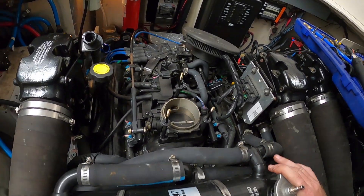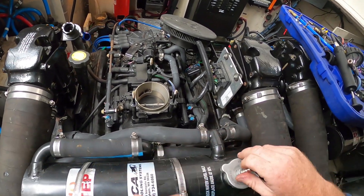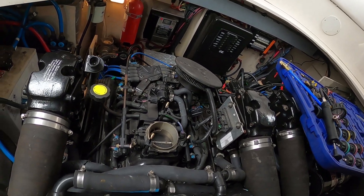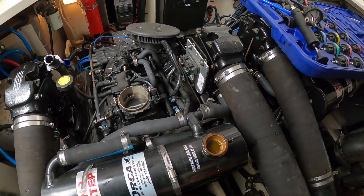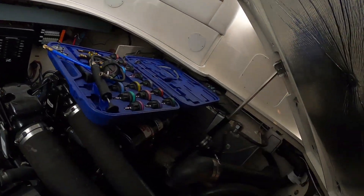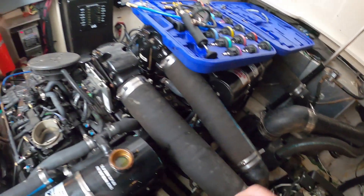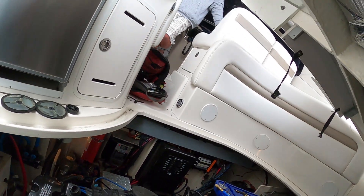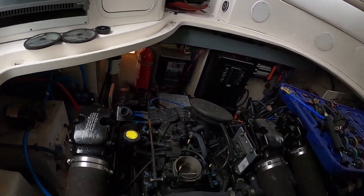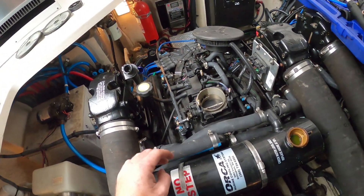The other thing I think we should do is a full service as well as cleaning the bilge out so we can tell if there are any leaks. With that oil in the bilge we're not sure if you have an oil leak or if somebody just spilled a little oil when they were filling — both are entirely possible.